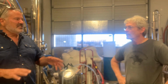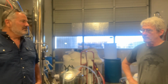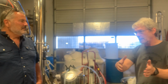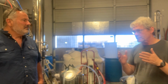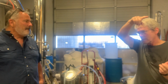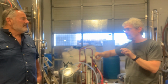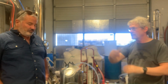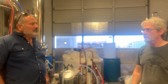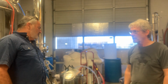So what happens to the first nasty stuff? Well, the really nasty stuff, eventually you're going to have to destroy it. But as you're moving through this progression, there's some good alcohol in there, because you're sort of going bad stuff, less bad stuff, and then good stuff, right? The good stuff is in there. You just have to redistill it very carefully, and you can get some more good alcohol out of it.